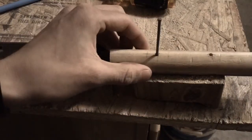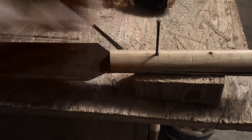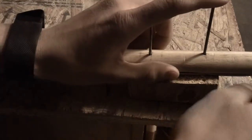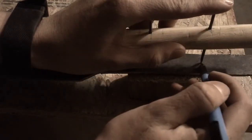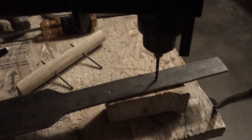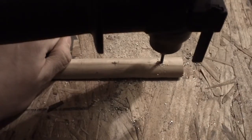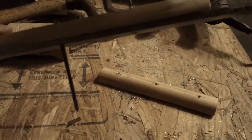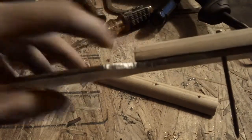Right now I'm hammering the first nail into the wood through the pre-existing hole. To make sure that the other hole is in the right place, put another nail through and trace where it meets. On the spot that you marked, put a nail there and hammer it a couple times so that there's a guide for the tip of the drill bit. Then drill the hole. Now drill the holes on the other end of the dowel. When you put something through the holes on the first dowel and the holes on the metal, it should line up like this, with enough space for the guard.